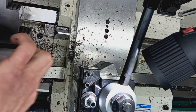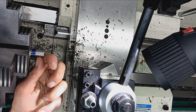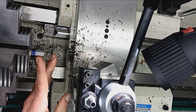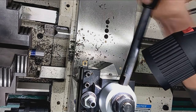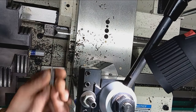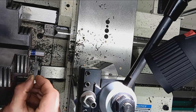The other thing I do when it's an unknown device is I'll put a relief in the back, simply because some muzzle devices don't have relief in the front, so they need a little clearance to get all the way to the shoulder — just to ensure everything's going to work. So that's a hundred-thousandths grooving tool; I'll go ahead and put a little groove in the back there for clearance.